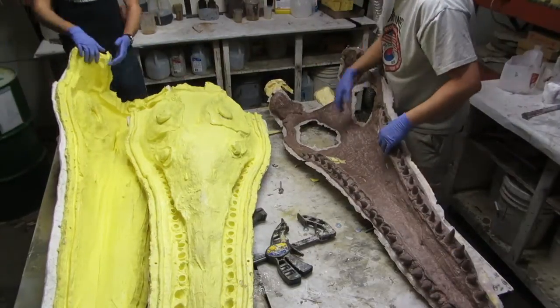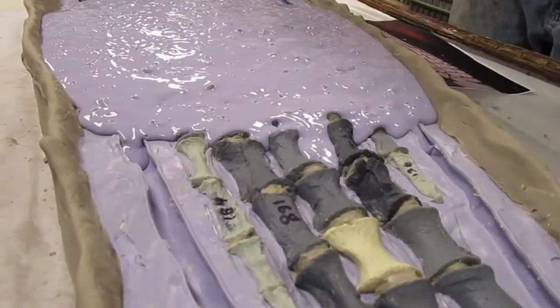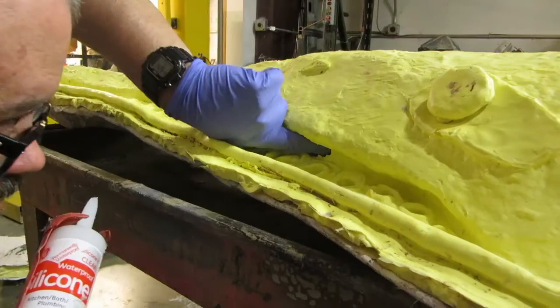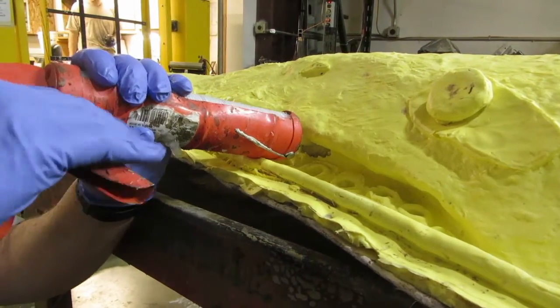The skull was fine, but the molds we made — we had to use more curative agent in the silicone. More curative agent means the silicone sets up faster and gets harder, so our molds were done sooner. The problem is that when you use extra curing agent, the silicone is going to be less durable and not as strong — more prone to tears and rips, and the mold won't have the same longevity. We have to do a little bit of repair work to the mold before we can use it and have our Megacephalosaurus skull poured and done.